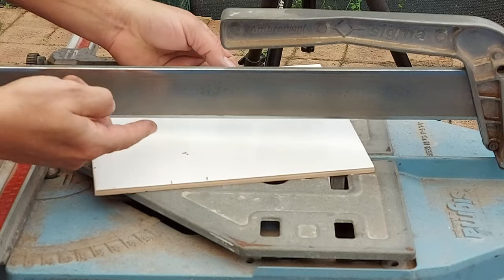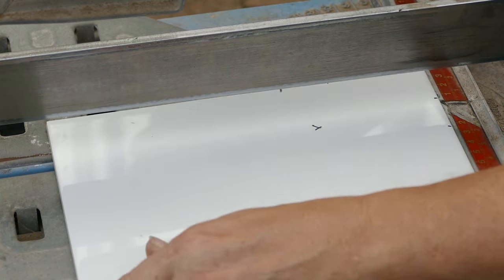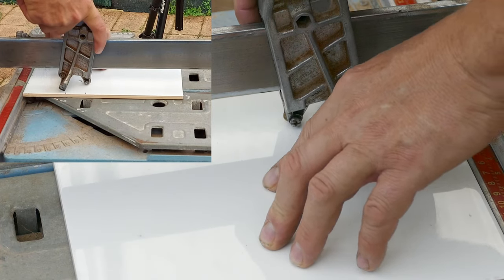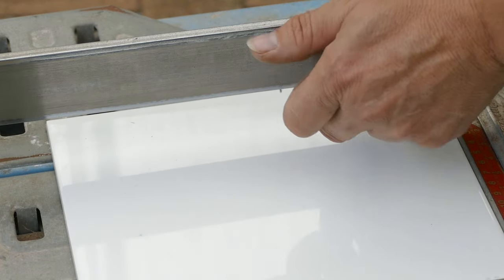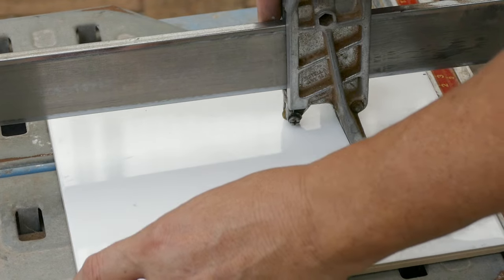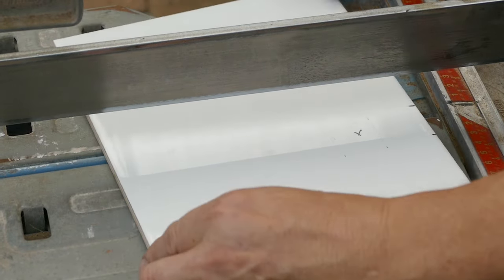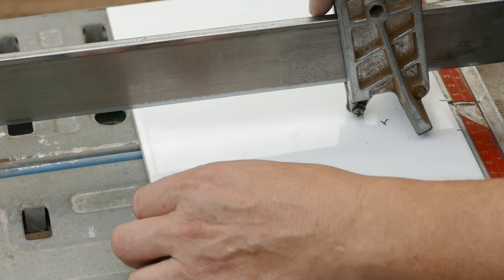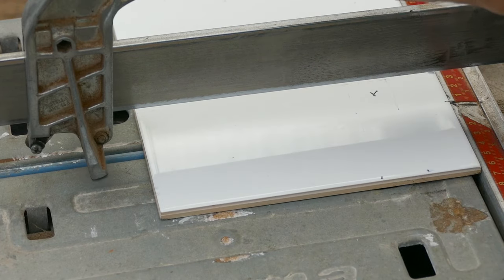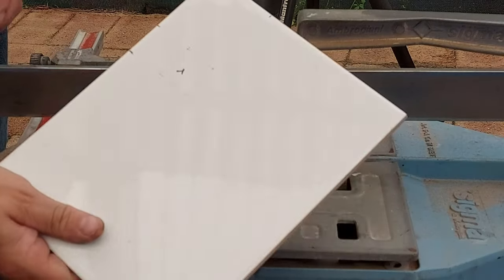We've got our four marks and that's roughly where we want our point to be. Don't damage the tile. On our cut point, just pick one of these marks one at a time — we're going to create a square. Bring that down to there, cross-sector. If you go slightly over the mark it's not going to matter, because remember the hole that we want is slightly larger than this. Again, swing it 90 degrees, bring it over. Much easier this time because you've got two scribe marks already. Slide that over to that point where it matches. Now we have ourselves a square.